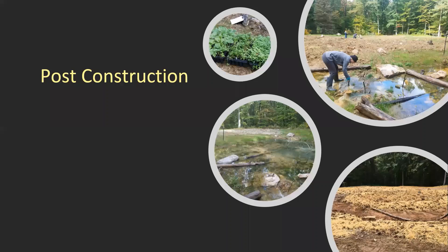After construction, we seeded the exposed areas in the meadow and around the edges of the wetland with native upland and wetland seed mixes depending on the soils, and spread straw to prevent erosion and stimulate seed growth. In September we returned to plant some perennials — native to Pennsylvania, specific to the region, and appropriate for the conditions. One thing we learned was that the rough and loosened technique looked fabulous initially, but there was enough clay in the soil that it hardened and nothing grew at first. We considered bringing in additional soil, but as we discussed options over time it sort of took care of itself and everything settled out. Lesson learned: be patient, give it a year or two to right itself.